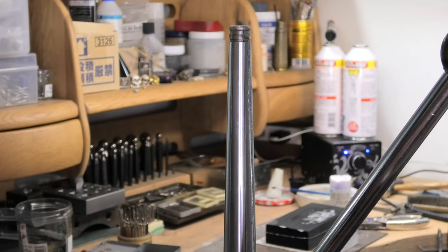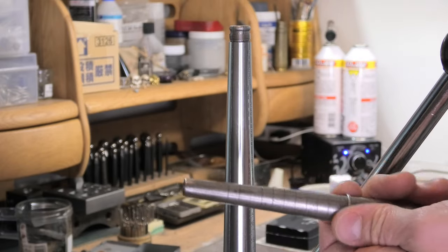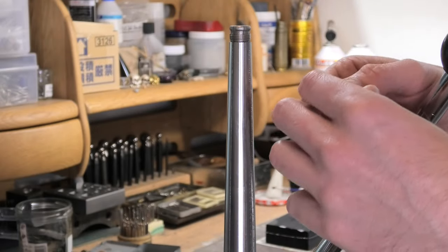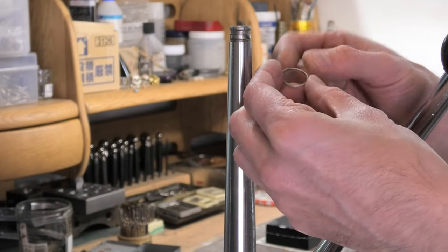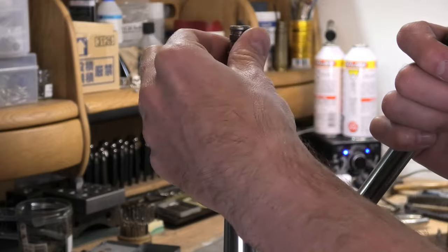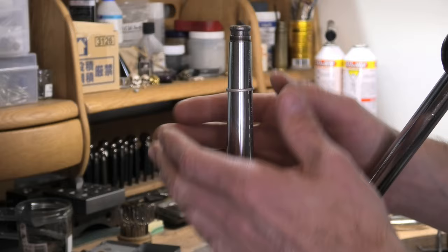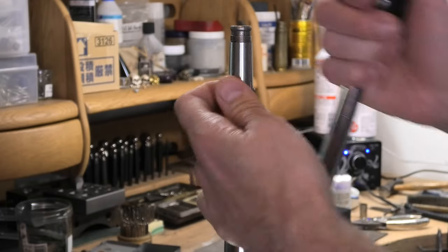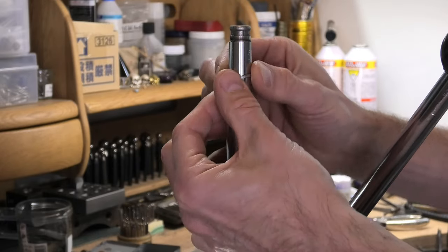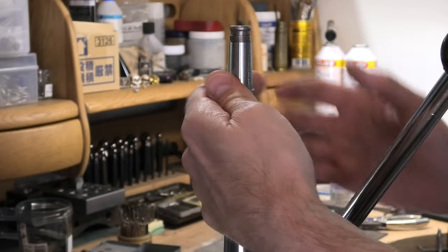You should know what the size is before it goes on. Give it a few pumps, go up half a size or one size, and then anneal it again. It depends on the metal, how thick it is, whether there's engraving inside — just a few factors like the condition of the ring. Sometimes a section is really thin, just where it's worn from the way someone wears it. Then turn it over and do the same. Because it's slightly tapered, you don't want to push one side out. Turn the ring over so you don't end up with any coney shape to the shank, and keep it horizontal — don't try to stretch it slightly tilted.